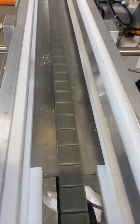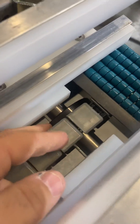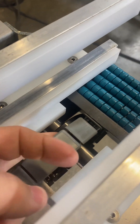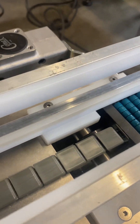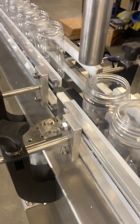Your chain — this is a uni-style chain. You want to make sure that you do a really good job cleaning this machine and keeping it clean — air hose, whatever. You can get some caking on these. This is a sprocket driving a chain underneath here. Make sure these stay clean on either side and your machine will last a long, long time. If these start getting caked up and you're not cleaning them, these chains can break. That's just what happens with machinery, so you have to make sure you're keeping everything clean.